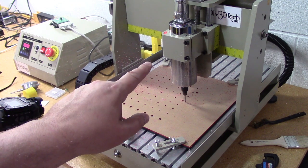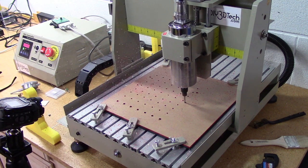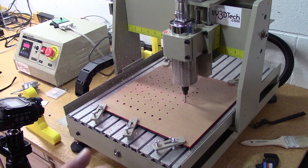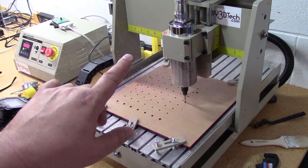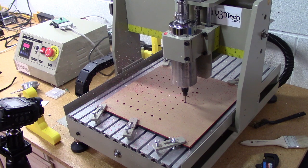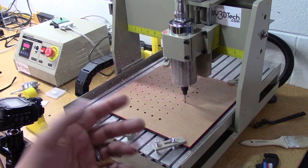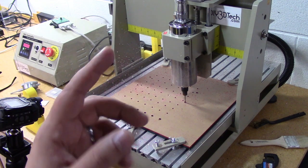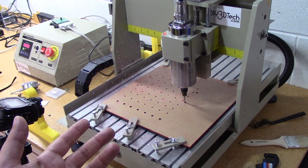For those that commented — yes, I had to move the spindle down quite a bit from where it came stock. I've also put tape rulers on it as I've done on my Probotix, so I can kind of measure and index. All I had was imperial with inches so that's what I added, but I will replace this with metric — I do prefer working in millimeters.